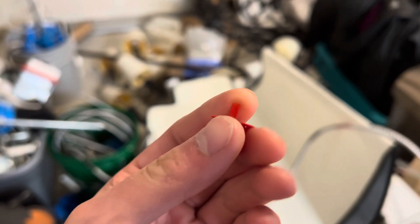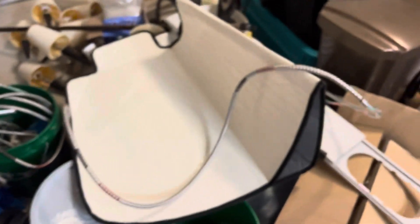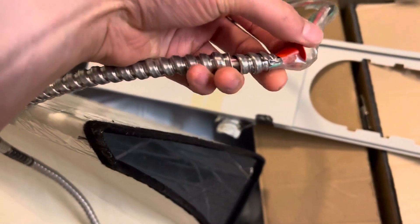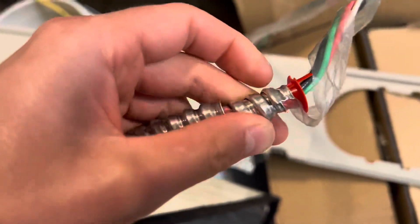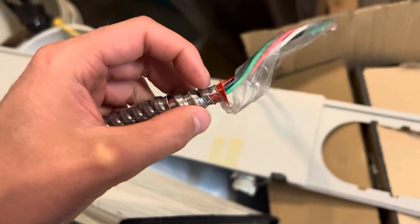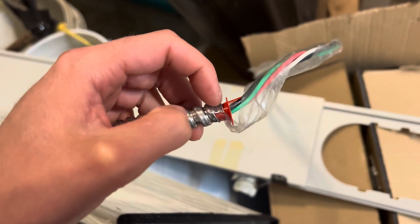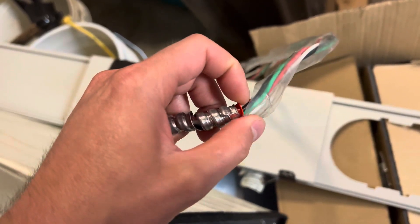Basically, they're just this little circular piece of plastic. For commercial wire like MC, you just slide it over the wire and then slide it down into the wire like that, to protect the edges of the wire so that the sharp corners right here don't nick the wires. If it's the hot wire, that would be a short, and it would just explode and trip the breaker — nothing would work.